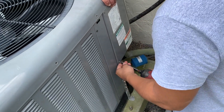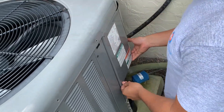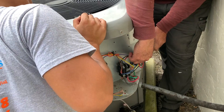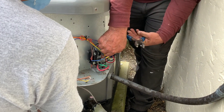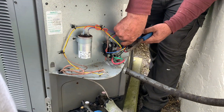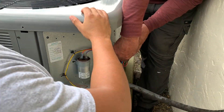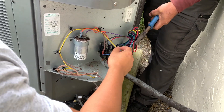There's a plate over here that has all the electrical components — it's got the capacitor and all the wires that come in. We've got to get in there because we've got to cut some of these ties that are around the wires so that we can move this top off of the unit itself. It's probably a good idea to double-check to make sure that the breaker's off, because you've got your fingers right next to where the electricity comes in.